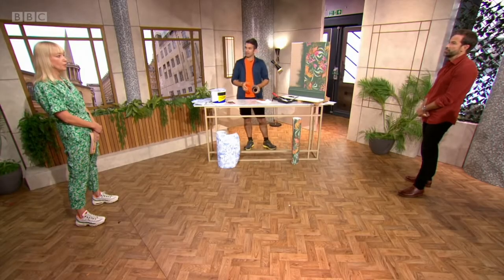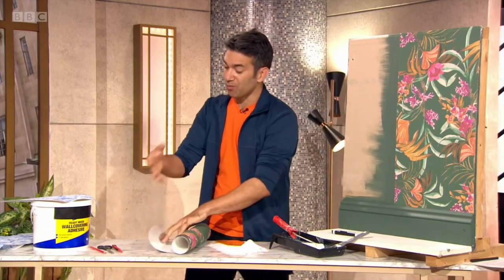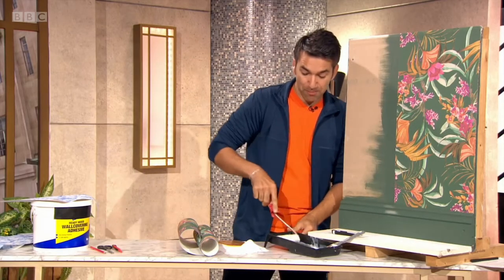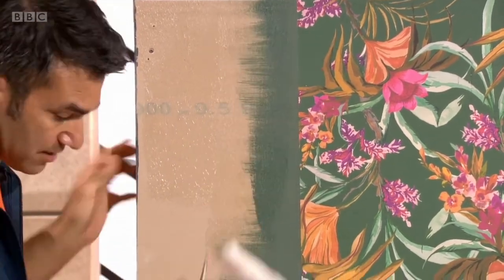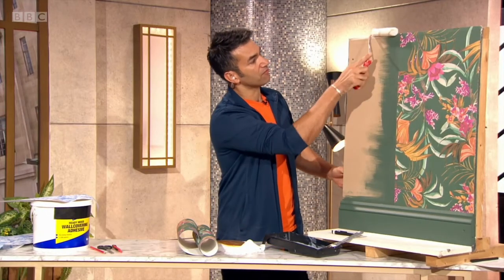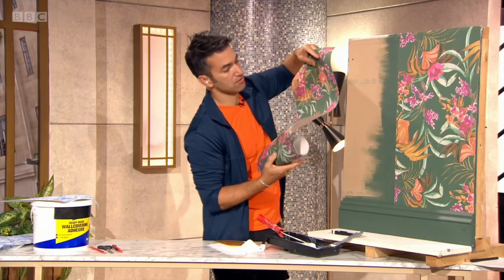We were talking about bubbles and apparently it's not champagne — how do we get rid of them in wallpaper? Well, before we get to the bubbles, we'll put on the wallpaper first. There's the old way where you'd put paste on the wallpaper and let it sit. Now the interior design world wants you to paste the wall instead — and they've even made the paste pre-mixed already. So you literally paste the wall. I've pre-done one already for you, and then you match it up. Pre-cut your wallpaper lengths ahead of time, but bear in mind the repeat pattern.